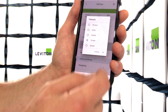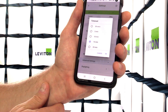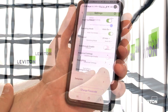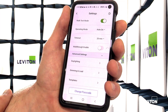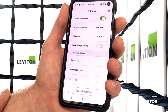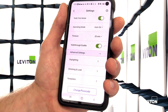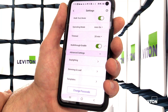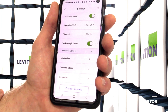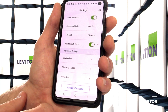For timeouts there are options from 30 seconds all the way to 20 minutes. The device will be in the 20-minute slot by default. For applications such as aisleways or corridors where traffic might just be walking through, you can enable walkthrough mode, which reduces the timeout to two to three minutes unless there is additional activity — then it will use whatever normal timeout is selected.